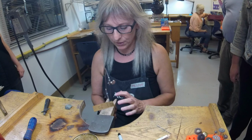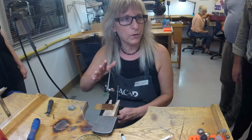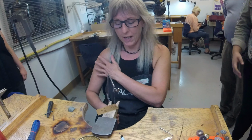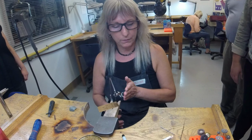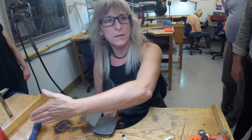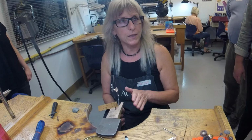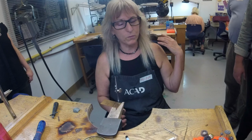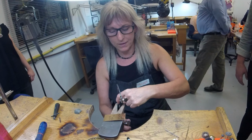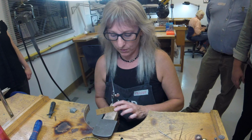The other thing I should mention is, just like when you're writing, you have your book at an angle, so for right-handed, you want your arm comfortable, and you're going to be sawing in this direction. Left-handed, you'll be sawing in this direction. You don't want to go straight. I have the bench pins at a straight V because I don't know who's going to sit here, but on my own bench pin, the V is at an angle. My V is pointing this way more. So you want to make sure your arms and shoulders are comfortable.